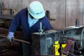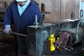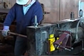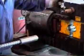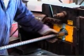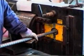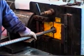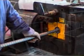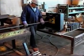The rebar does not require bar end preparation. After swaging couplers onto the rebar, the process is over and it's kicked off the table and ready to be shipped to the job site. The installation of the couplers to the rebar takes approximately 20 seconds. Along with no bar preparation and no installing of the thread protector by the operator because it's already installed by Barsplice Products Incorporated during the manufacturing, it's the ideal coupler for fast-track projects.